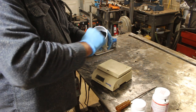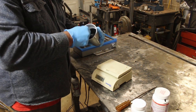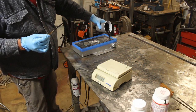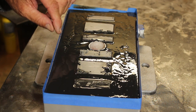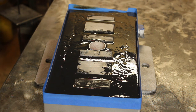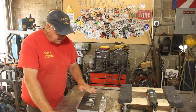One thing you want to do when you're mixing epoxy is always scrape the sides and the bottom while you're pouring. The epoxy is crowning just above the top edge. There are a couple of air bubbles in there — come in with a torch to get those out. Now we'll let that cure and then flatten off the top.